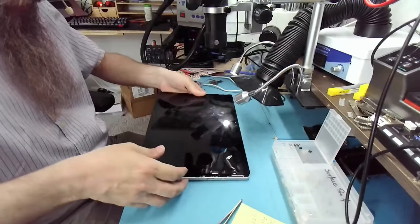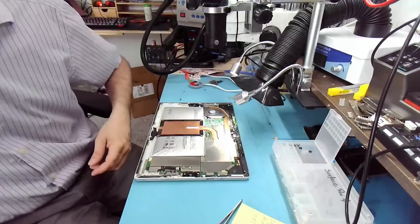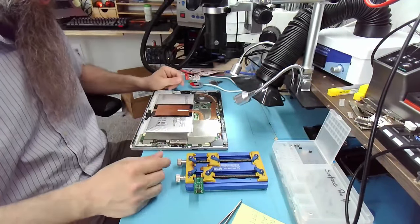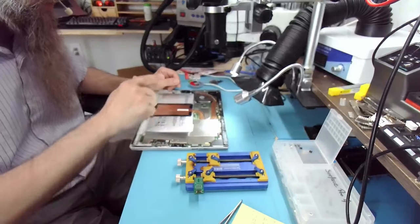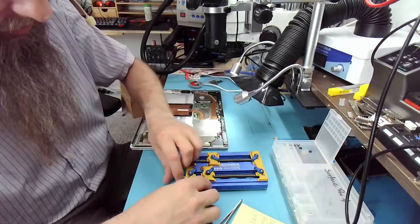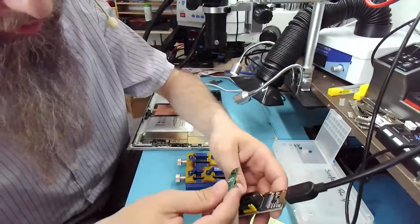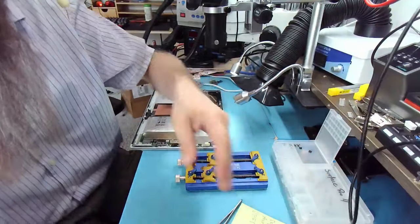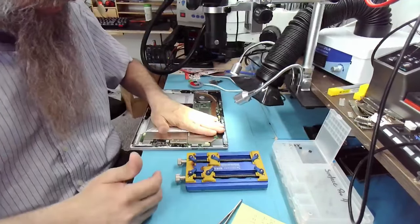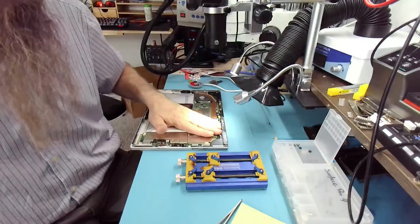Okay, so here we have an example of a corrupted BIOS. As you probably noticed, the computer wouldn't boot. Then I figured maybe the soldering was bad. I tried a few times. It didn't help. So I replaced the solder, because I figured maybe that connection is just not good. Still nothing. It draws 35 watts, so it boots properly, but nothing on the display. And usually that is when there's something wrong with the BIOS.